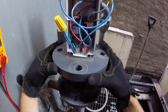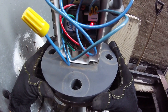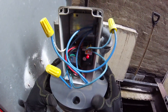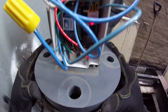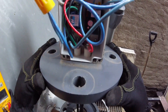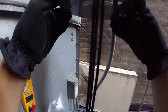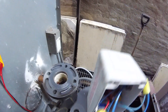Let's lift this up and see what happens. The light turned off. The light is on — we have water in here, so this is keeping us normally closed. We're going to lift it up — pay attention to the light. Boom, right there, we switched over. There's soap on this probe and a bunch of dirt on it. That's not cool, but it is doing its thing.